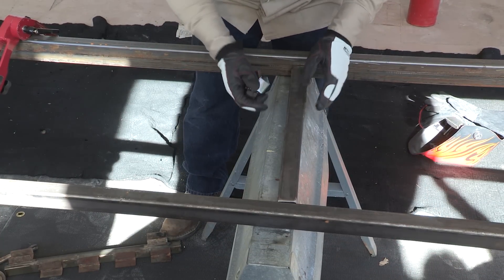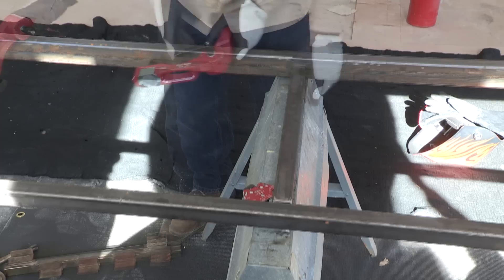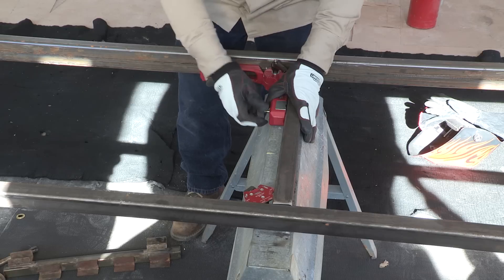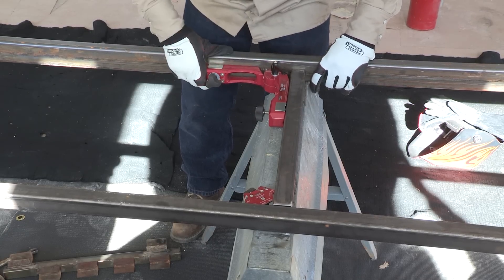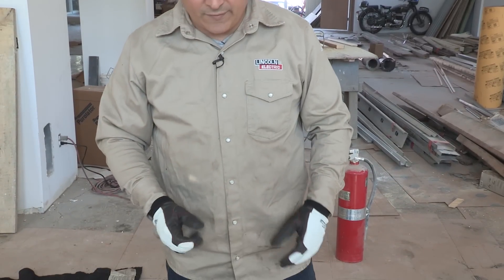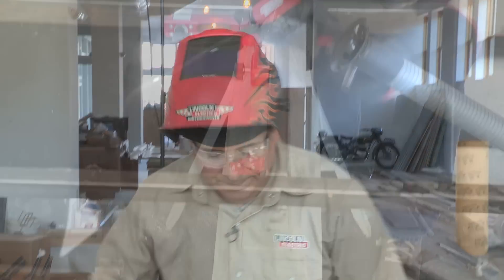We've moved over to the second piece. I'm going to line it up to the marks I already have on the material. Use our mini multi-angle. I'm going to use the pivot angle here to help keep everything nice and straight — I already got it set at 90 degrees. When I'm fabricating steel, I like to use the steel worker gloves — a lot more dexterity when you're working with a tape measure, clamps, and fitting up. Now I'm going to change back over to the MIG gloves and do some welding. The MiniFlex is here because we're indoors and there's other people working in here, so we want to capture all the fume we're generating.